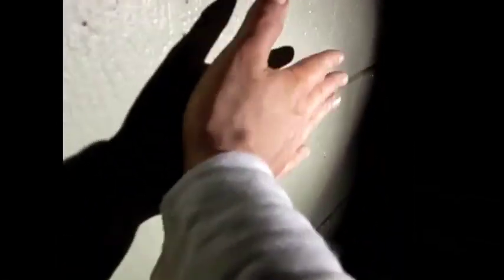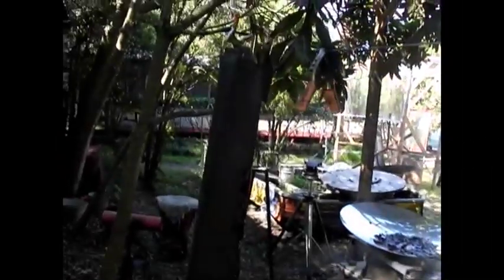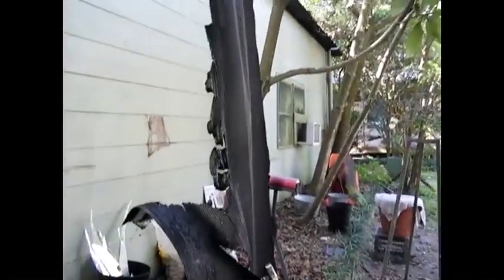The reason this doesn't affect the brick wall is because it's a light color — it gets hot, but if this wall was black I wouldn't even think of pointing it at it, because it could actually damage the concrete. If there was moisture in there it could steam and crack it. This is fluted paper, and this shows you reasons why you don't want pieces of cardboard sitting around, and also why you don't want it to come over to stuff like this. I'm taking these mirrors down right away. This also proves that plastic siding — if a neighbor's window just happens to be at the right angle — can actually melt the siding off of a house, or even burn it down.